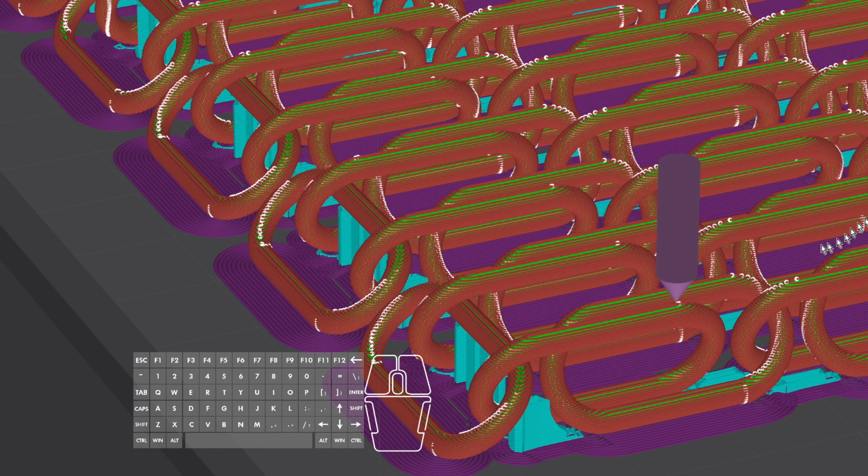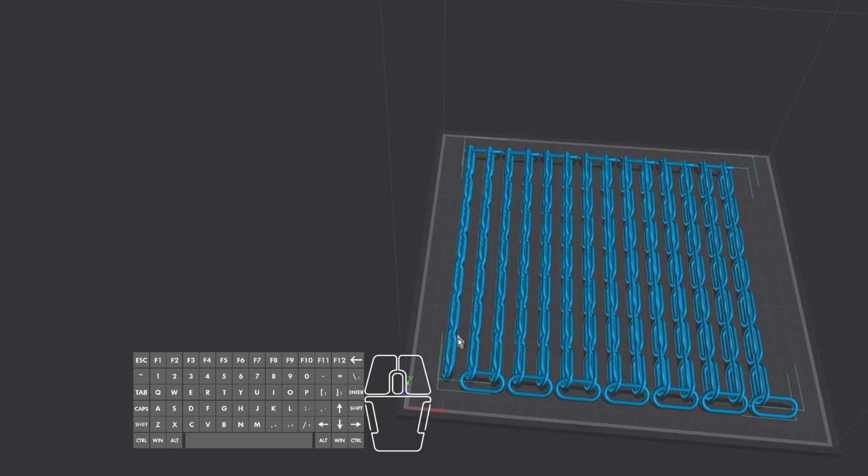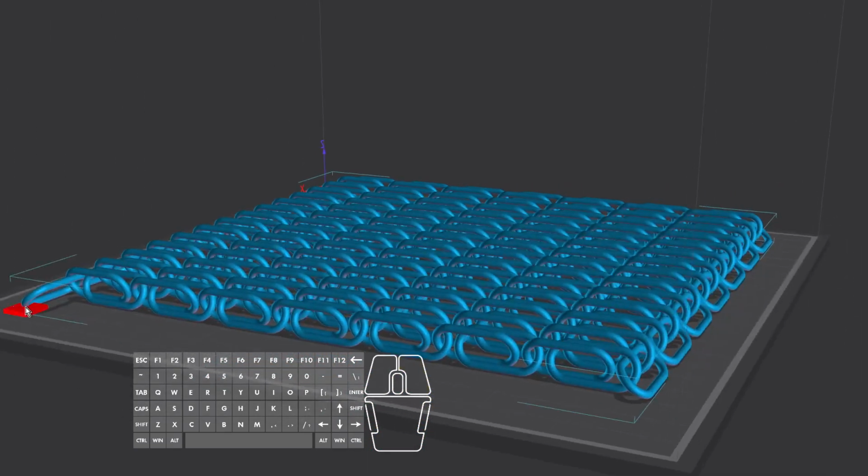So instead, I'm going to go to plan C. So let's go back to prepare and add some supports manually, which I don't enjoy doing. But sometimes you gotta do what you gotta do. So hopefully it'll let me add manual supports and then also add the tree supports. I'm gonna bank on that all these y-axis oriented ones are not gonna fall over. But I am concerned about this guy falling over. I don't need the support this wide. Let's go five millimeters.